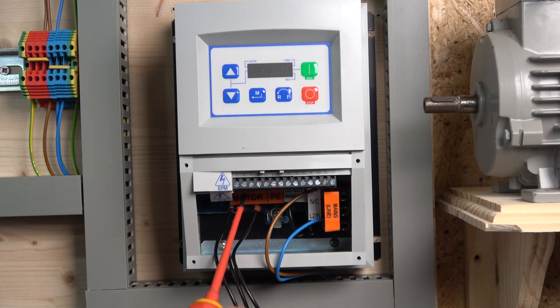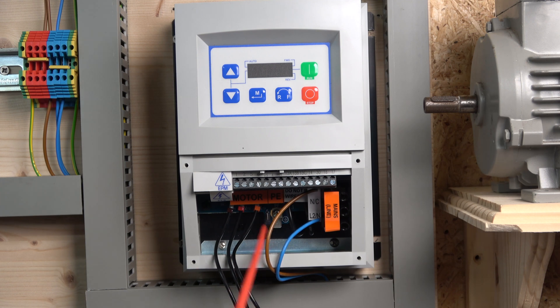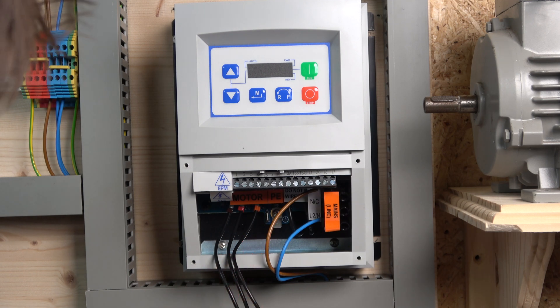This is where your motor connects — you can see the motor terminals here — and your mains comes in here for L1 and L2, where L2 is your neutral. You can also see the earthing points here. I haven't connected the earth for the time being as it requires a push-on connector. This is also where your EPM module sits — standard for memory on Lenze drives.